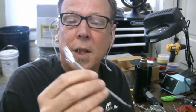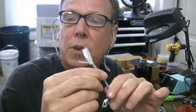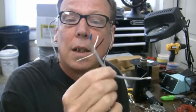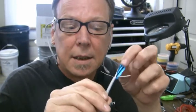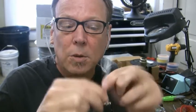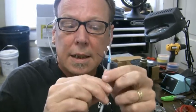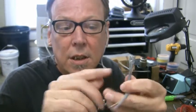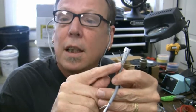The real issue with it is that if this ever bends while there's signal running through it, if somebody were to step on it, or you bend it suddenly, it's going to make a high frequency noise. That's because the capacitance in this foil changes as it moves. It's not steady, it's not static. As that capacitance changes, it induces a change in the conductors, and that manifests itself as a high frequency click or pop. You can hear that in old snakes when you move them around.